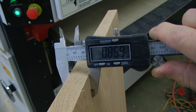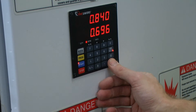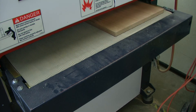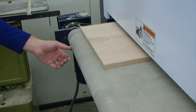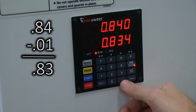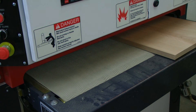Using a digital caliper, our board is about .84 inches thick. After setting our machine, we can run each face of our top through so that it cleans up any mill marks that the planer might have left. We want to take off as little as we possibly can, so we're only going to send it through one or two times on each side. Because our top is so wide, we are going to only bring the machine down one hundredth of an inch so that the motor can handle the amount of width that we have on our board.